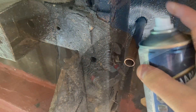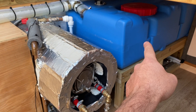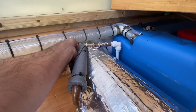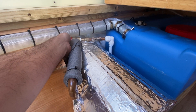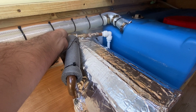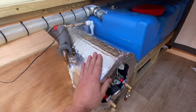I'm now going to start filling the calorifier to check for leaks. I'll crack open the supply valve at the bottom — the pump's kicked in and we're filling the cylinder, taking cold water from the main tank and filling the calorifier through the bottom. The system's up to pressure on the secondary side, so I just need to let the air out through the safety valve here. The pump kicks back in after venting — I want to vent it until water starts coming out the safety valve, so we know it's full all the way up. Water's starting to come out now, so we know the calorifier is full on the secondary side.